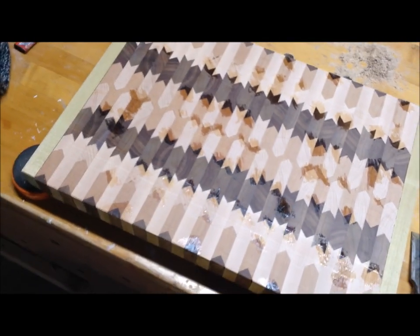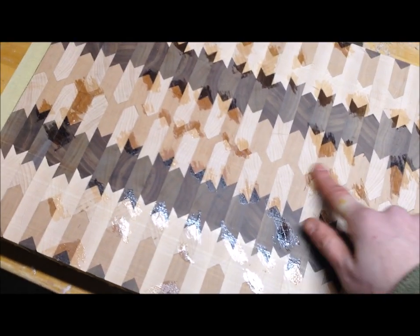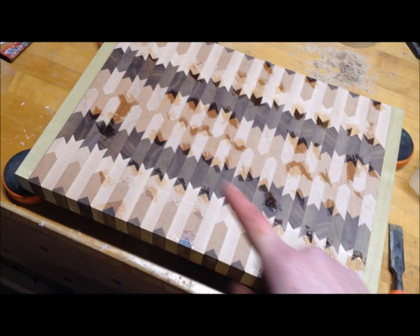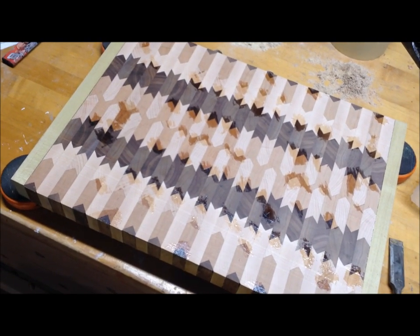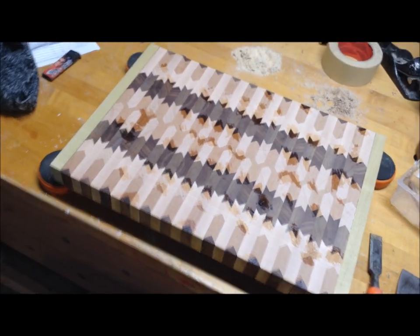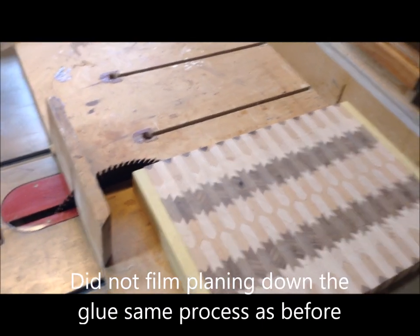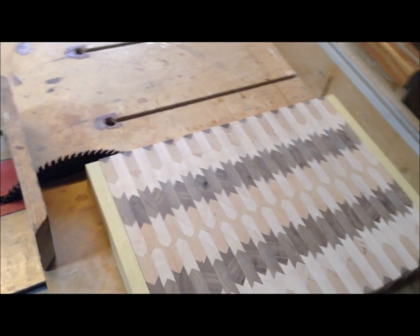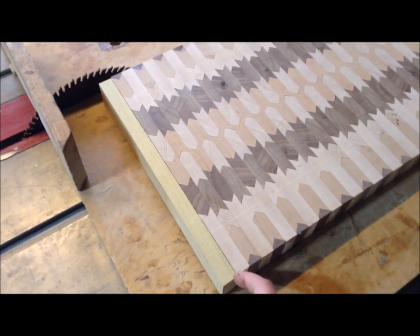This all set up for a little bit, and now I'm going to send both sides back to the planer — it should only take about one or two passes. Before it got really hard, I went through with a chisel and scraped off a lot of excess, so there's not a lot of excess epoxy. It's all pretty flat. To finish off all the edges, I'm going to be using that same cross-cutting blade — I think it's a 60 or even an 80 tooth blade. I'm going to square this up on my cross-cutting sled and leave the poplar pieces on there so I cut it all off at one time.